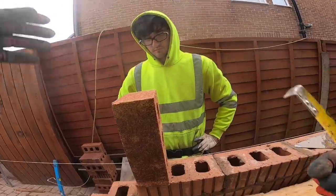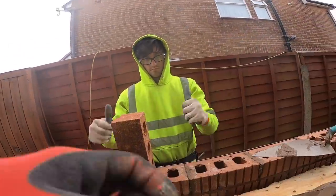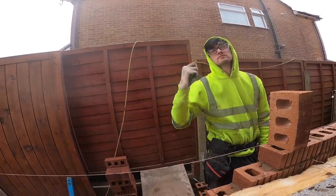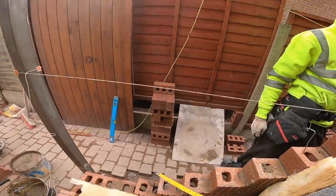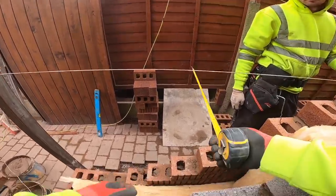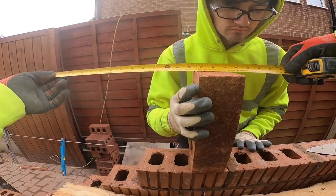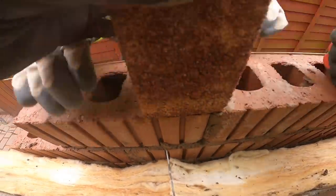Well, just put that in line with that joint. She said make the window work brick, so that's the window. Square head up there now. Keep it nice and plumb. 1250 ish, 1260. That's an 800 window and a 450. No, hang on. Two brick only comes to the... I think we said 2.5 brick, which is 575 plus 800. 1375. That's it.